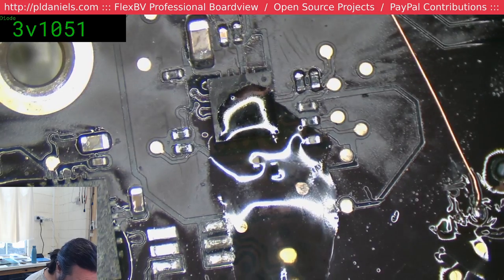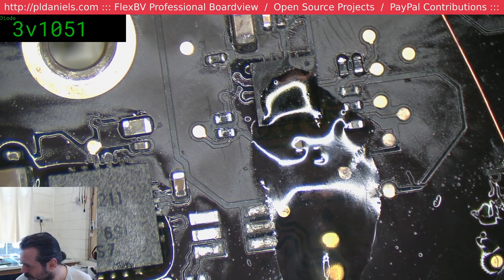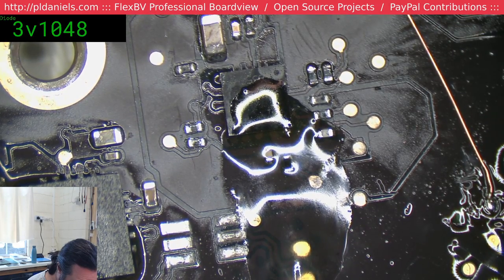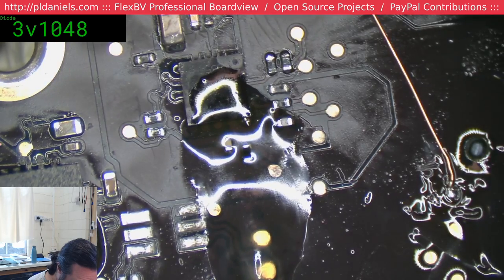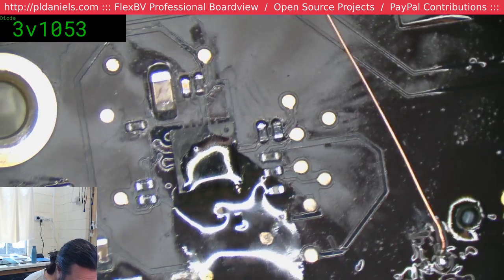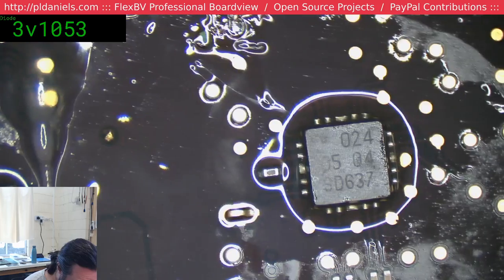One six five. Well, at this point, what I might do is just knock off all the resistors. What the heck? Why did you fall over for? And check under them. Make sure everything's okay. Yeah, just kind of weird. I just tested D7701, and that's what I was going on. It's 0.12 in forward mode, which is about right for those diodes, and 3 volts in reverse, which is also about right.